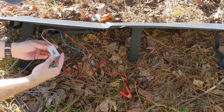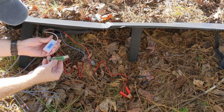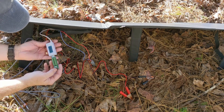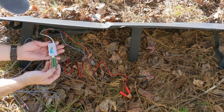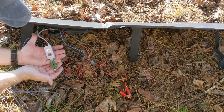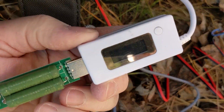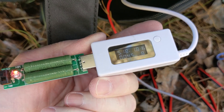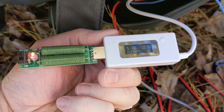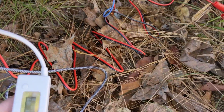If I hook up my little USB tester, it shows 5.26 volts. I'm going to hook up a 1-amp load — 5.18 volts at 0.9 amps. If I go to a 2-amp load, will it hold? Yep, 5.18 volts at 1.77 amps. It's just a resistive load, but showing 1.85 amps at the moment. Going to unplug it now.